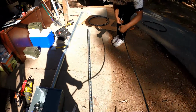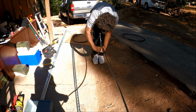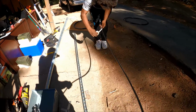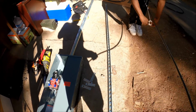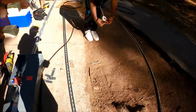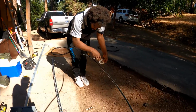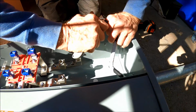identifying the neutral wire. So when Edison comes up, they'll hook the neutral wire, which is traceable to ground. So we're identifying that before we put it in this pipe here. That's a 10-foot rigid pipe. And we're going to put this masthead on the end of that. I'm trying it a little different way, but good job, Mark. As soon as you press it. Yep.